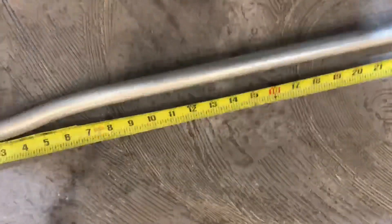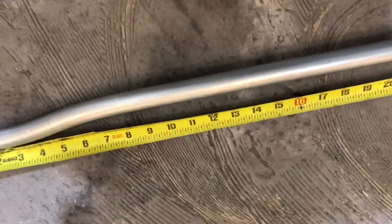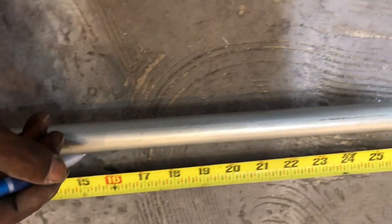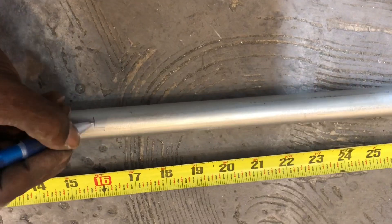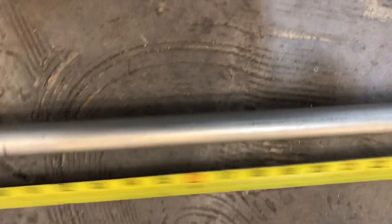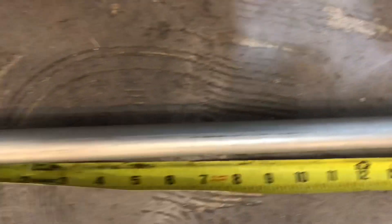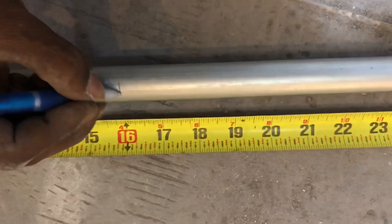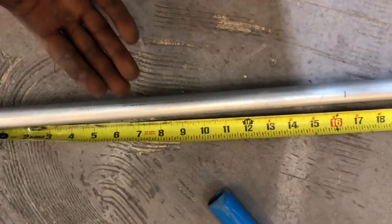For our offset, we're going to be using 30 degrees, which is times 2. Our first mark is at 16, because that's where our first up-kick will be. Then from there, we will need to go 16 over for the spacing to make the other bend. Let's go 16 over. This is the location we need to do our two bends to get an 8-inch increase through the pipe.